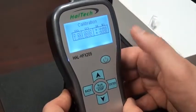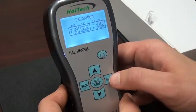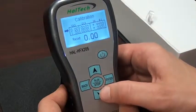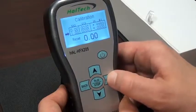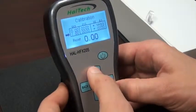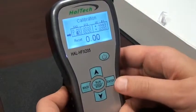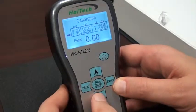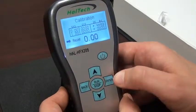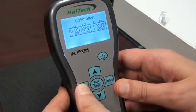The calibration screen shows the factory settings and has been designed for user calibration. Following the instructions in the manual, if I took a calibration point and want to change the value of my upper entry — say it was actually 1.2 ppm — I can change that setting. If I want to go back to the factory default settings, I can choose reset, and doing so we see that we went back to 1.0 ppm. That is all there is for the calibration screen.